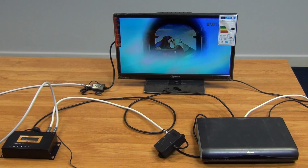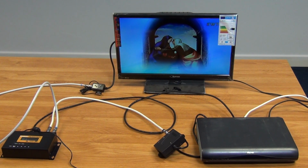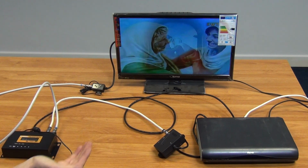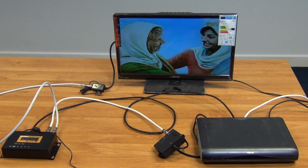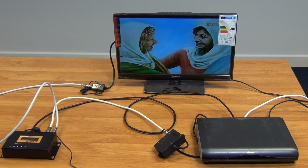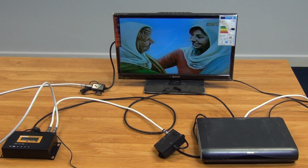If you could imagine a situation where you have your set-top box in a central room, and what you want to do is you want to change it to a digital signal, distribute it over, but we'll say from a bar or something like that, you actually want to be able to change the channels, you actually have a modulator that supports that return path through it. It's a really, really great feature, and we were hoping that feature would work. We just actually experimented away and discovered it worked quite neatly for us.